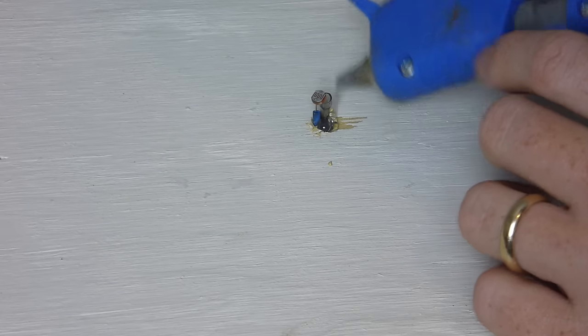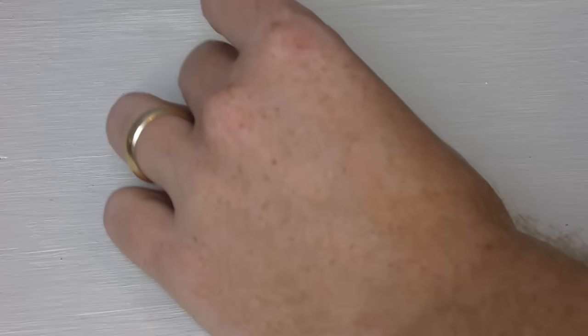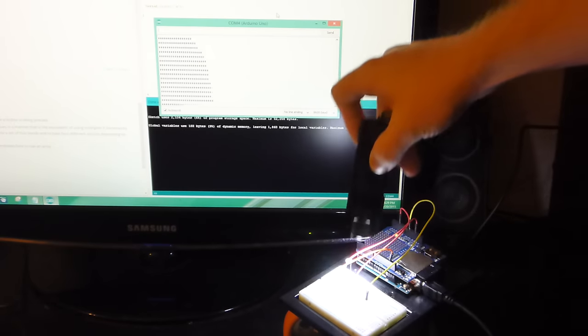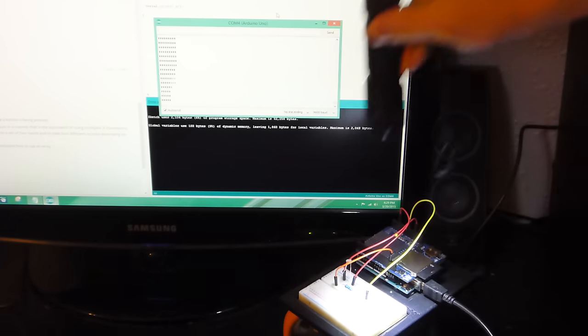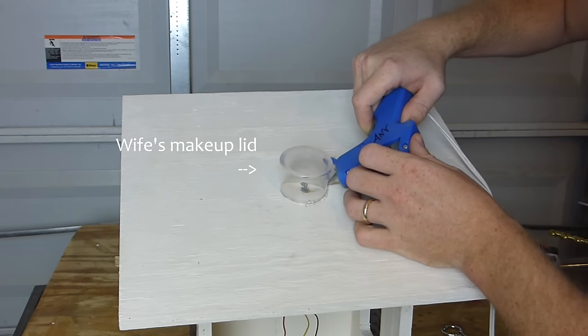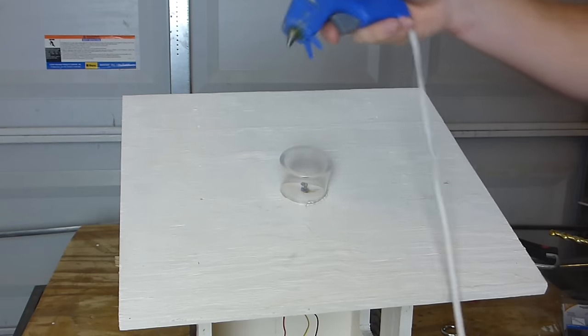My sunlight sensor is a cheap and simple photoresistor. Its resistance changes based on intensity of light, and you can put together a simple circuit which allows the Arduino to read this as an input. I actually made an attempt to calibrate the sensor based on the known brightness of this flashlight. I have no idea if it's even close to correct, but I have the code reporting this data in lux, which is the SI unit for illuminance.